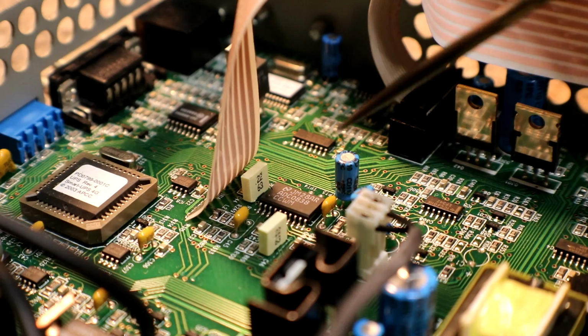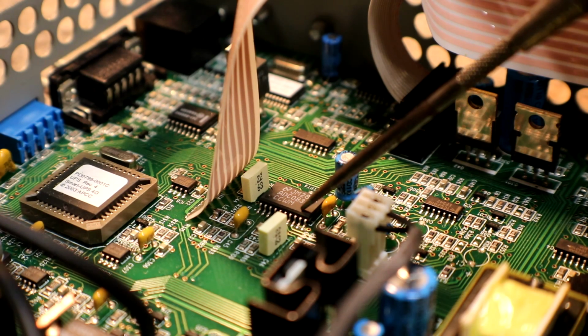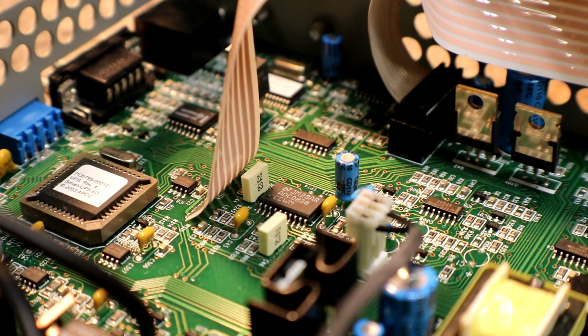Okay, so in Nar's video, he was able to take pin 2 off of this chip right here to 5 volts, and that was able to make this UPS constantly go into sync mode, which would be kind of cool if you wanted to use 2 UPSs like this to get 240 volts AC. Of course, your amperage would stay the same at the 2700 watts, but you would have 240 volts. In the future, I may try this, but right now I am not going to.